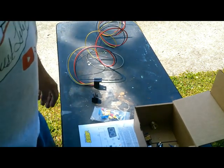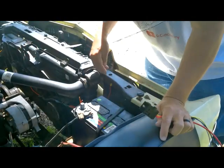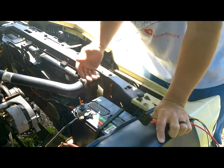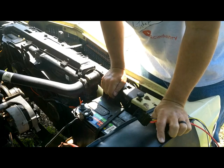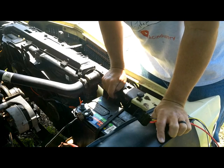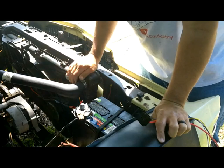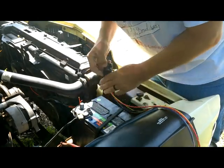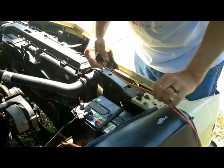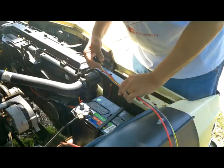Let's get an idea of what we're going to do here. If you remember that other system we had that immediately didn't work — it was my fault because it was made for 15 amps and the fans carry more than that. So this one's made for 30 amps. These fans carry about 16 amps, so we should be good. It says to mount these as close to the fans as possible, and I'm sure that's because they don't want this big long wire — this thing is like six feet long.